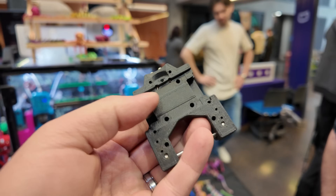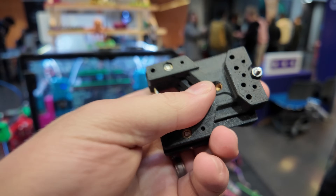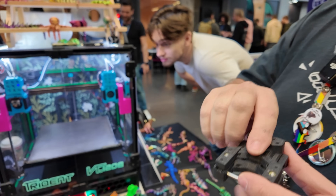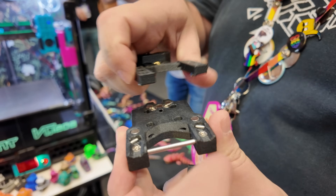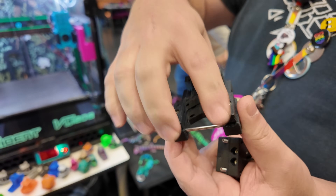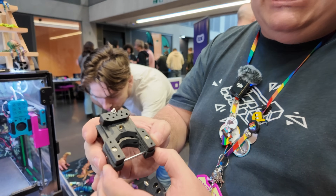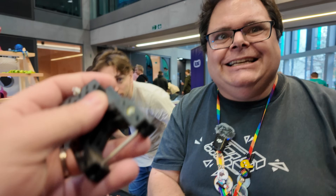There's a small amount of motion in the coupling which allows a tap-type action. Because there's an electrical coupling between the two points, you can wire up an end stop across it for a tap probe. It can also serve as an X end stop and a Y end stop just by nudging it out of alignment — so the whole system can do quadruple duty.